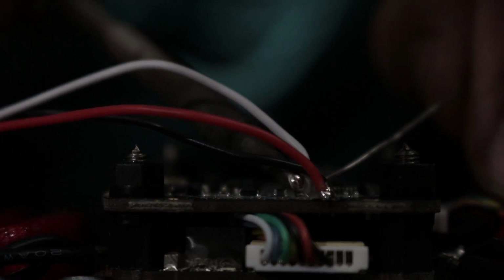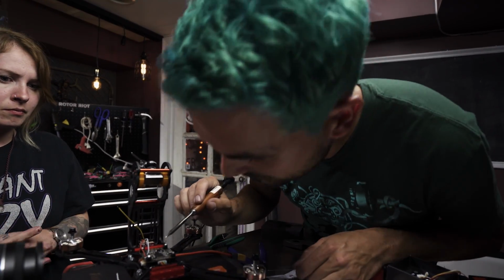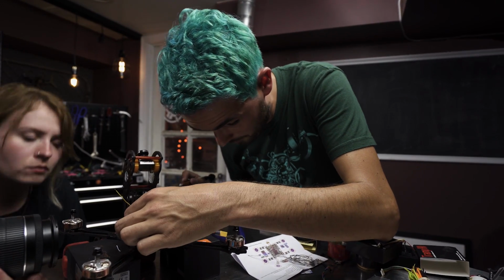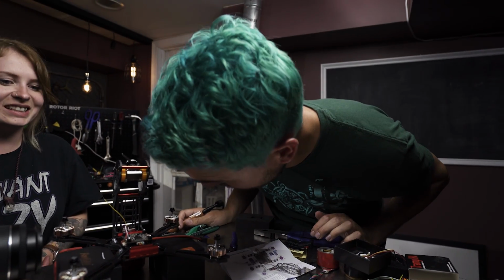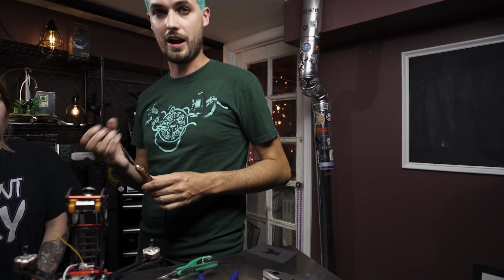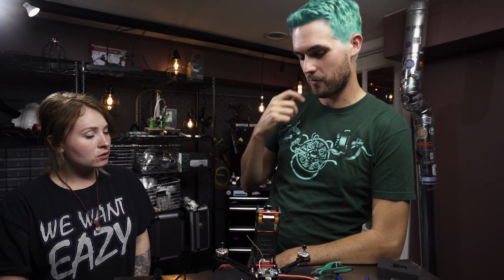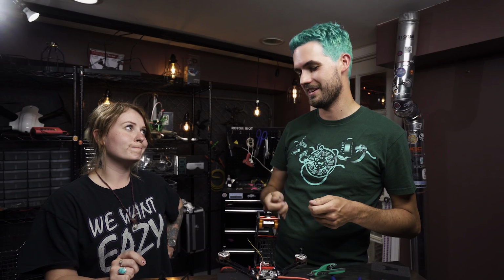And is it okay if it burns back some of the sheathing? Is that what it's called? Yeah, you want to avoid that, but these components usually come with silicone wires, and if you're burning back silicone wire, you're way too hot. Okay. But some of the components, like honestly, my Spektrum receivers, the coating isn't silicone, which drives me crazy. I've been asking them to change it, and yeah, that'll melt back, and then I usually will cut it. So when I'm soldering up something that doesn't have a silicone wire, I'll make the wire way too long because I'm probably going to mess this up. And so when it burns back, cut it, try again. And the secret to that is just trying to move fast enough. So like I said, use a hotter temperature than you think you need, so you can just go in and hit it.